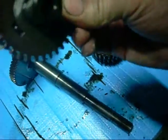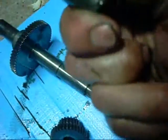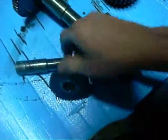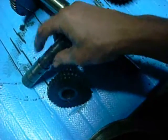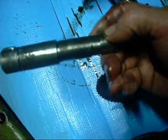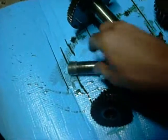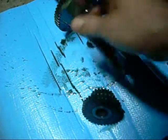I've given these a quick rinse in heating oil and they've come up pretty good. This one here has had a blocked oil passage for God knows how long and it's worn way over size. I might remake that shaft — there's a step on the top there where it's worn in. Not too hard to do on the lathe and milling machine at work.